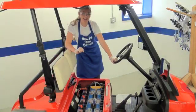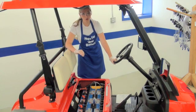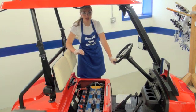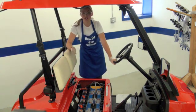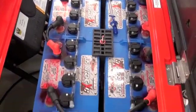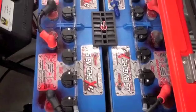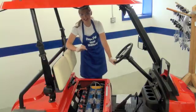It's always good practice to tie down heavy gauge battery cables. However, do not tie them to the watering system as the tie-downs may restrict water flow. The system is now fully installed. One important note: you have to wait until the battery has completed its next full charge cycle before watering. Always water the battery after charging. And that's it.